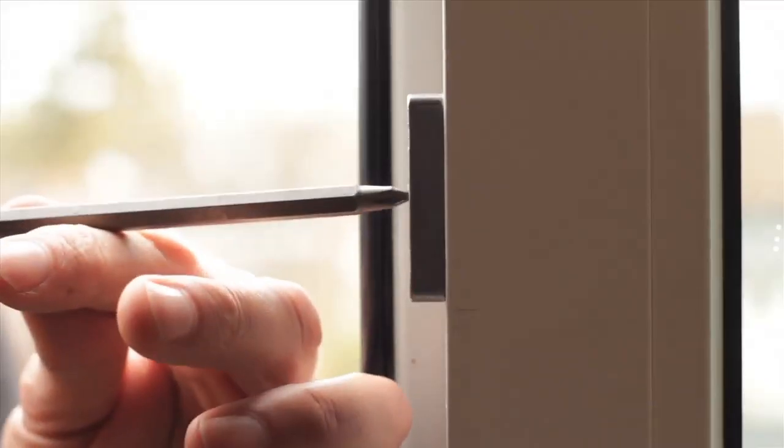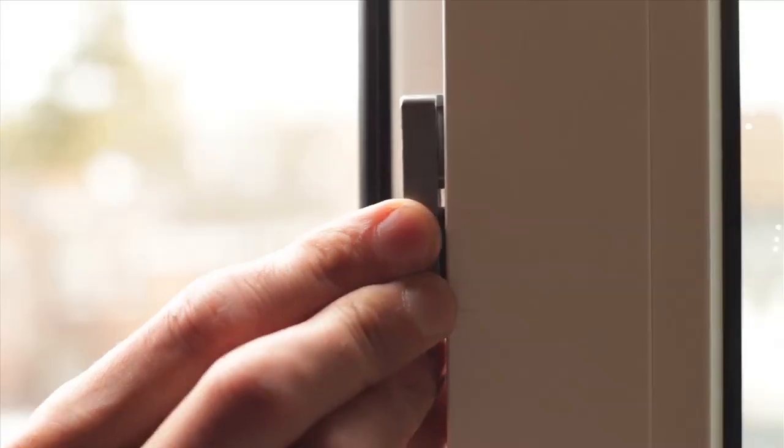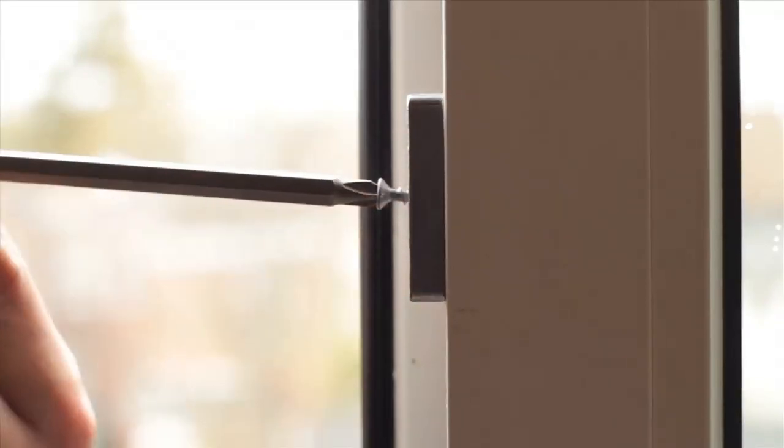Once the sash has been reinstalled back into the frame and all adjustments have been made, if any of the eccentric cam locks are coming into contact with the roller strike, the roller strike can be repositioned on the frame. Start by removing the Phillips screw that holds the roller strike into place. Reposition the roller strike and install the Phillips screw back into the roller strike. There's small teeth on the lower strike that will hold it into place as you're making these adjustments.